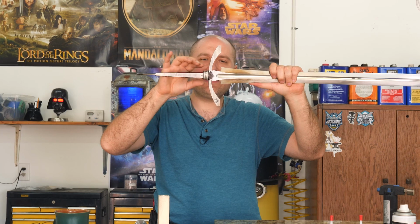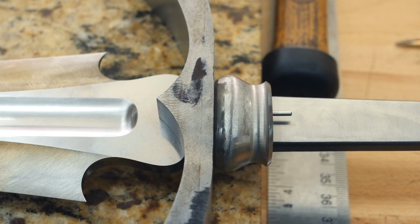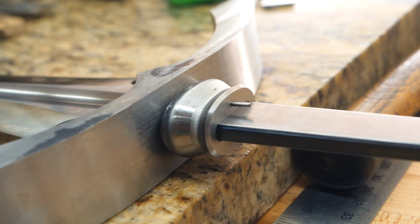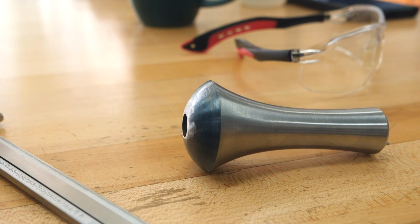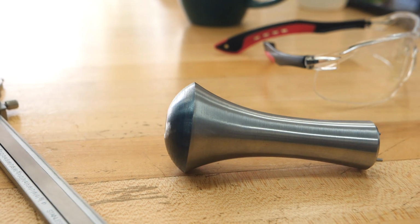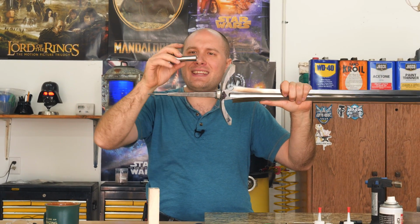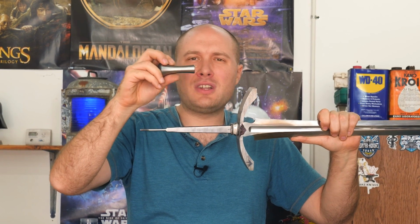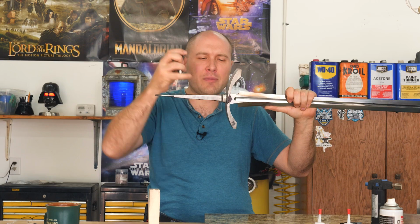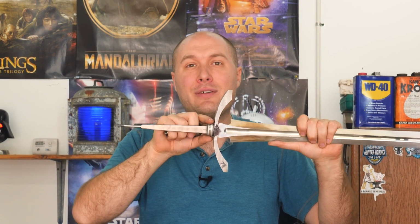They're not exactly the same because the ricasso is a lot longer than the front spacer, but I wanted it to look like it went together. Also, in another way, I kind of made the shapes on the pommel similar to the front spacer as well, but they're different. This also has that little bevel at the front, and then just like the front spacer kind of dishes in, the pommel does the same thing, only it's way less dramatic because it's over a long distance. And then the end of the pommel kind of resembles this kind of bulbous area right here.